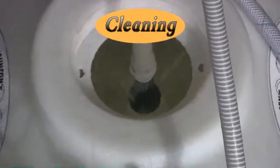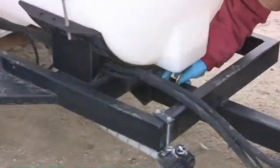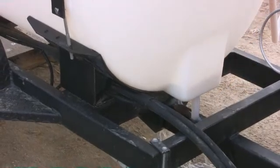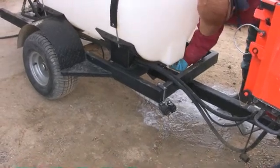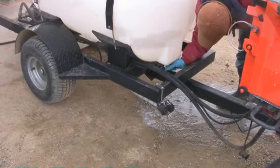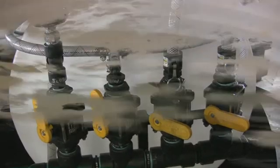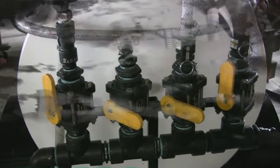After the feeding operation is complete, the system can be flushed, cleaned, and sanitized in three easy steps. First, drain all remaining product from the tank using the drain valves located at the front of the tank. There shouldn't be much if you are using the automatic system. Replace the drain plugs and, using the steps in the filling process discussed earlier, start to fill the tank. While the tank is filling, turn on valves 1 and 2, allowing fresh water to flow through. Now turn off valves 2 and 3 and turn on valve 4, the flush valve.